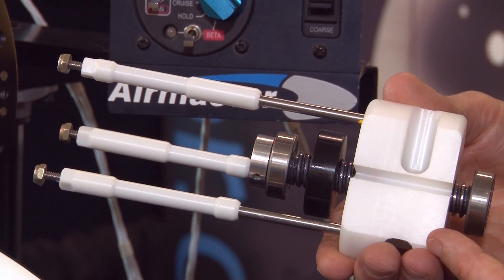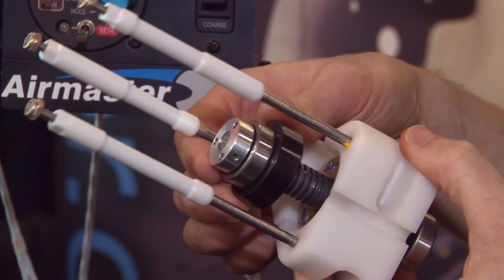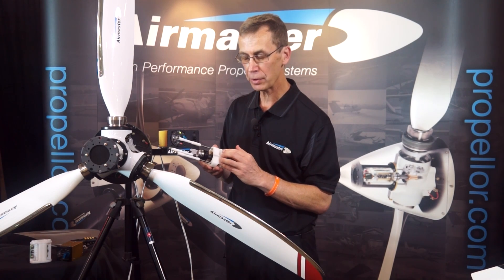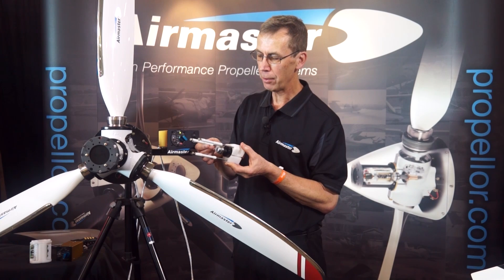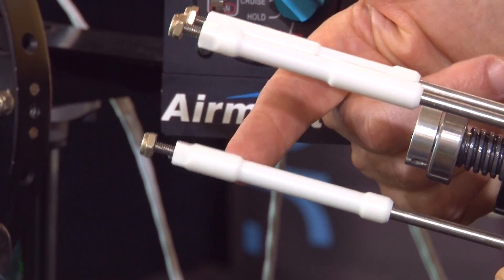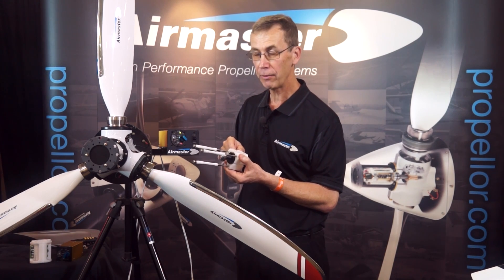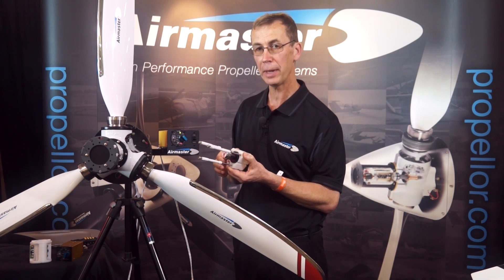This is the pitch change mechanism. The pitch change motor fits in here. When it turns, it turns the jack screw, and because that's made into a precision bronze nut matched to that jack screw, the block moves up and down. The cams which are inserted into the block and attached to the blade make sure that each blade moves at the same time at the same angle. At the top of the pitch change mechanism are the pitch change cams, which allow each person to set the overall pitch range for the propeller to suit their particular aircraft. There's a separate cam for fine, coarse, and feather. For reversing propellers, this cam sets the reverse pitch position. This block is made out of acetal plastic so that in the event of a ground strike, it will tend to break away the plastic but save the other more expensive components, making the repair more economical.